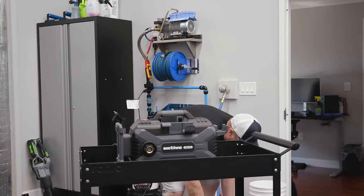And so this O-ring section of our M22 type fitting, M22 is the type of threads, this center insert is 15 millimeters. Most American-built pressure washers and higher-end pressure washers have a 14 millimeter diameter. If you try to use a standard 14 millimeter fitting, it's going to leak. You need this slightly larger 15 millimeter fitting. There's no tape that needs to go on this outlet. The O-ring inside here seals everything up.